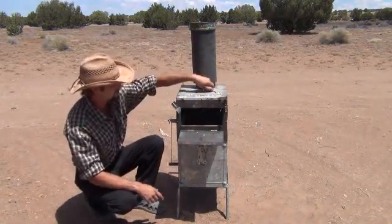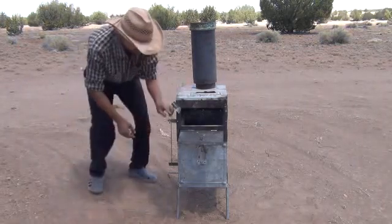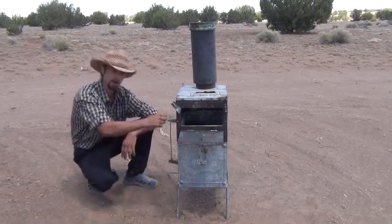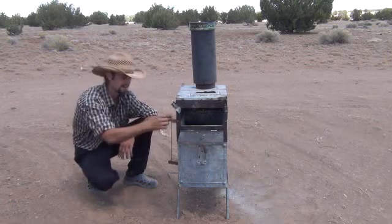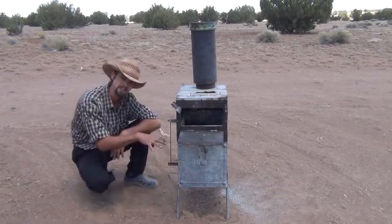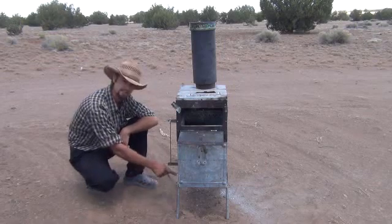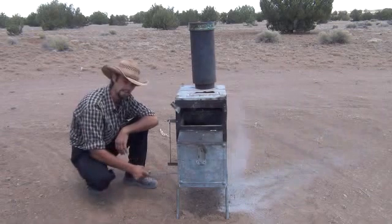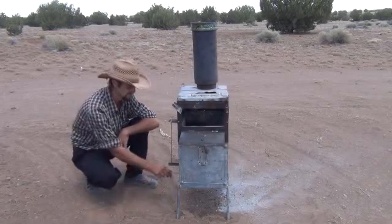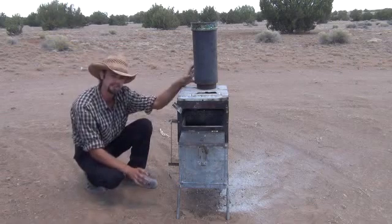Let me go through here and take you through the rest of it. I've got a little latch up here at the top that drops open so you can get in there and work the material around. Over here on the side, just like the system on the smaller wood stove prototype, you actually pull the little latch out and it'll open and shut the bottom of the main gasifier inside. To shut it, you just rotate it and it locks into place. There's actually a dump plate on the bottom of the main gasification chamber so that all the ash and all the coal that's not burned can dump out of the system into a catch tray down below. That's what this door right here — this little lever — you pull it, it opens up, and you can see some ash falling out of there. So this is going to open and shut your ash trap. I've already burnt it and there's ash dropping out.